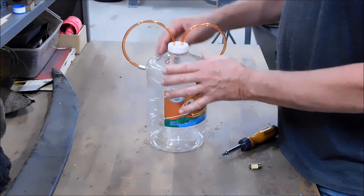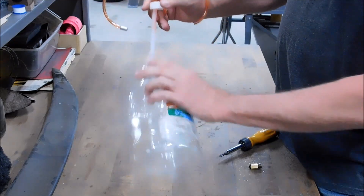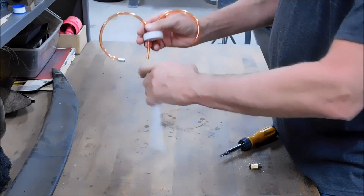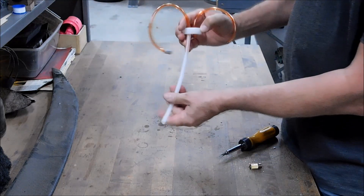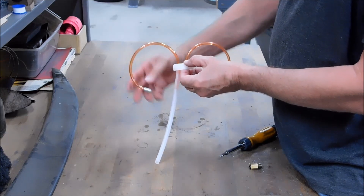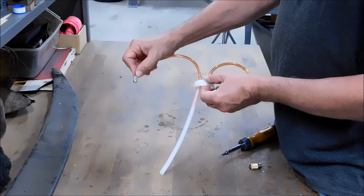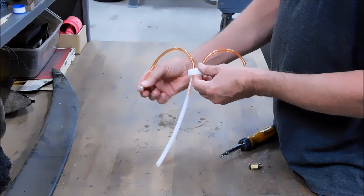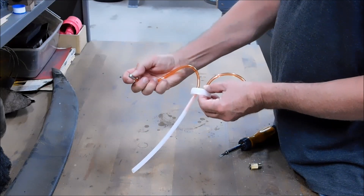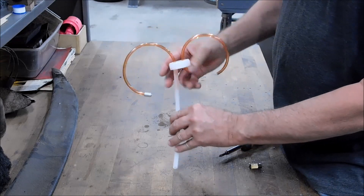This is what the final configuration looks like. Quarter-inch tubing, eighth-inch ID, flexible — two pieces. I have a piece of three-eighths tubing fit onto the end, because the flexible stuff will just curl up, so I use a longer, harder piece to reach the bottom. Slash cut so it doesn't form a vacuum against the bottom of your jug. I made a three-eighths diameter aluminum tip with a real small hole — I want a nice tiny stream, not flooding. A tip came to me from Jeffrey Lewis: the end of a Noga arm that attaches to your indicator makes an ideal mount for three-eighths tubing. Put this in your Noga, position it where you want it, lock it down with the magnet, and you're good to go. Mounting it to your machine would be a piece of cake. Jeffrey, thank you for that suggestion — that was a great idea.